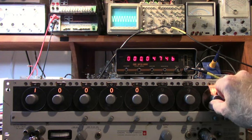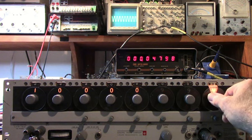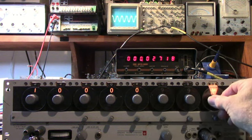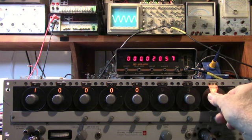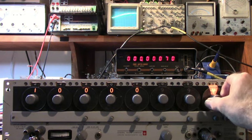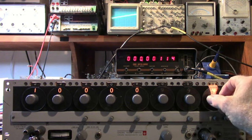I'll go back up — meters all the way to the right, we're at a higher frequency, a little over five kilohertz. As I approach the frequency — which would be the frequency that the last two locked-out digits represent — the frequency is lowering, and the frequencies are almost on each other. It went past it — right about there. A little bit of jitter in there, but that's pretty close.